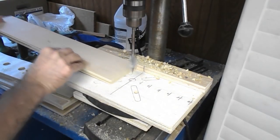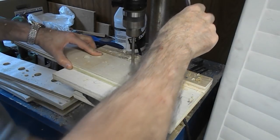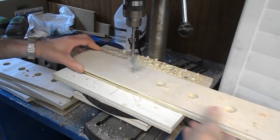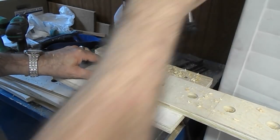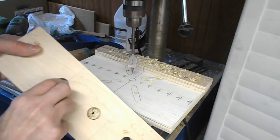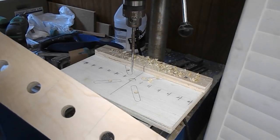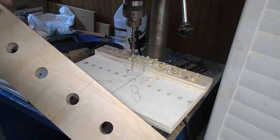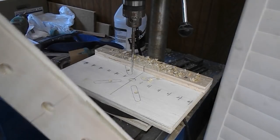And now I just have to finish them off from the back. Five perfectly even holes with no additional measuring. Now it is only for bus wires which are not going to be seen because they're under the bench work. But when I show up at the customer's site, I want my work to look neat. Neatness always counts when you're working for somebody else.